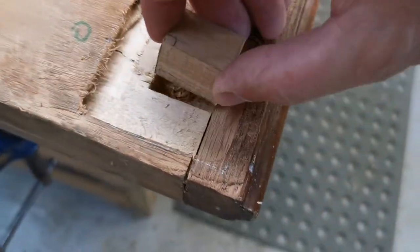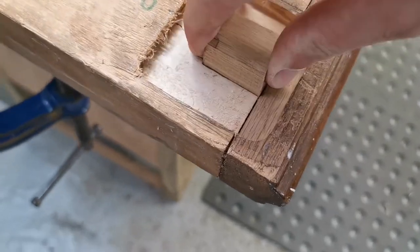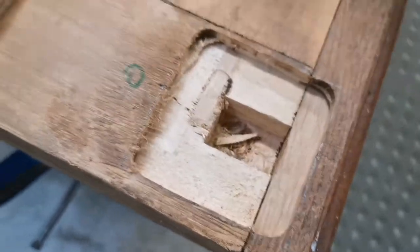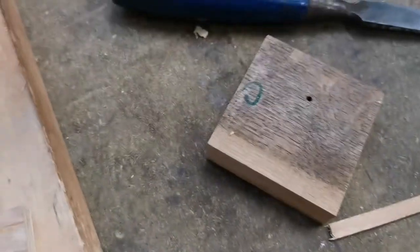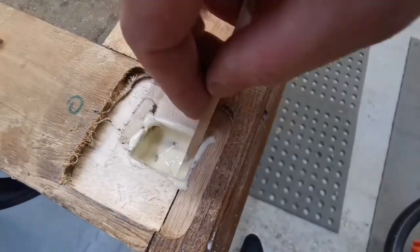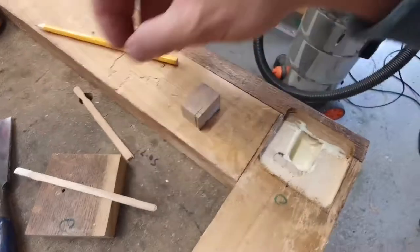There you go, block fitted. What I do is put glue around it and then G-cramp it down. Look at this wood - it's just really fibrous, this pine. It's not a very good structural timber. Hoover that out, glue that in. I've cleaned all the animal glue off - way too much glue on there but some of that glue can go in there for gap filling as well. Let's see how we get on.